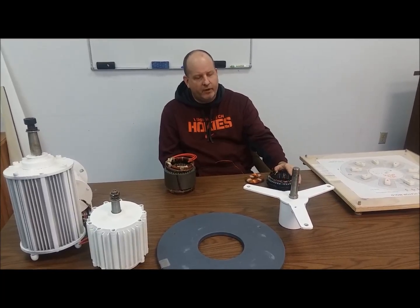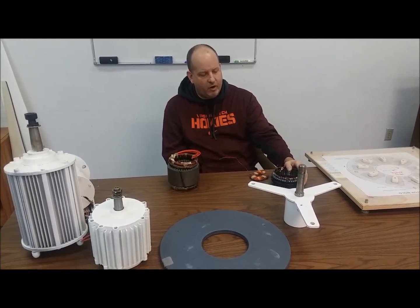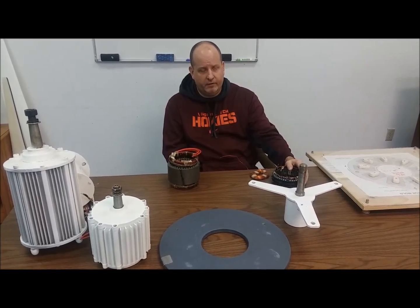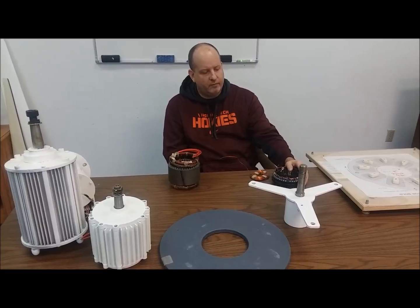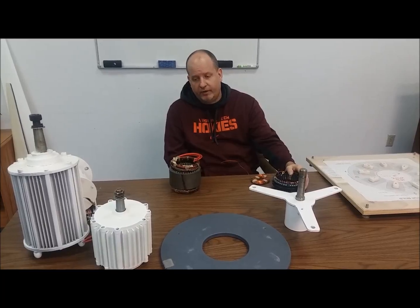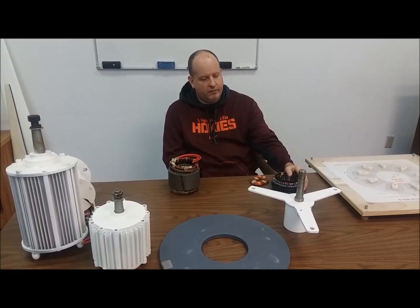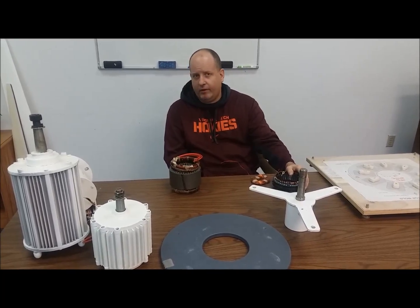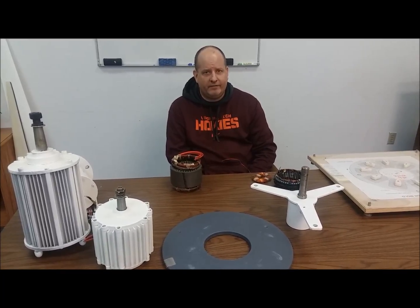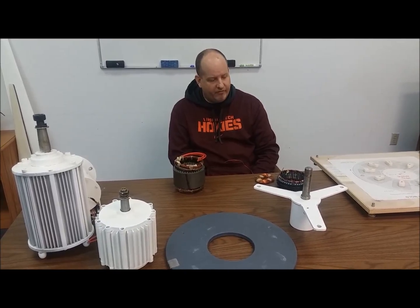The point is that smaller stators and smaller magnets generally require higher RPM. A smaller blade with a smaller turbine is going to help you reach the cut-in point faster. To address another point: if you have a smaller wind turbine and you want to buy a larger blade hoping to get better performance, those don't really match up — that's probably not going to be the answer to whatever problem you may have.